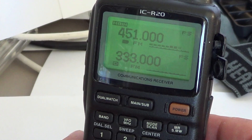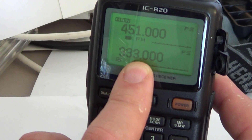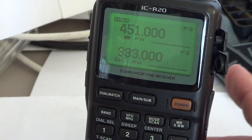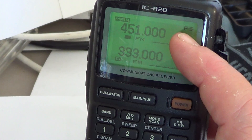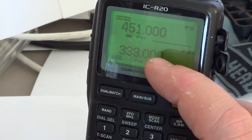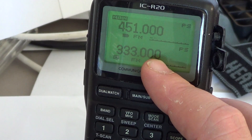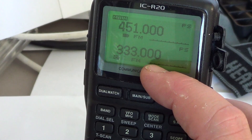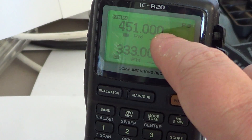You've got to remember one little feature: the top part of the display is the A side, and the bottom part is the B side. This is important because the A side can be programmed and tuned from about 150 kHz up to about 499.999 MHz. You cannot program two AM broadcast band stations together, because the A side will go to that frequency but not the B side.